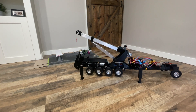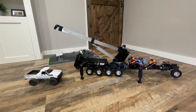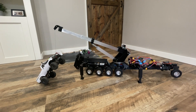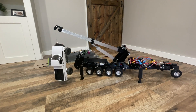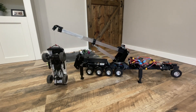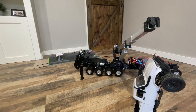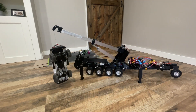Now testing the crane: I have one winch mounted on top of the crane — there's actually a spot for mounting two, but I only have one at the moment. I mixed my winch channel and the boom extension channel so the winch goes out as the boom goes out as well. You can see the winch has no issue lifting this truck, and I was happy to see no flex in any of my frame or outriggers — everything held nice and solid. I'm even able to rotate with the weight fully extended and I was not seeing any flex or give in any of the components.